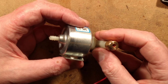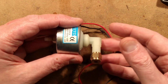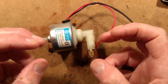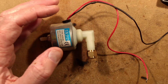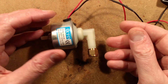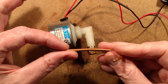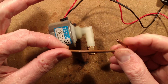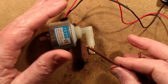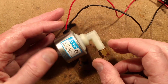Another thing that can happen with smoke machines: if you've been using cheap liquid or homemade liquid with tap water, which has hard deposits in it, the liquid gets boiled in the heater block and forms tiny droplets of glycol mixed with steam — that's the fog effect. But any mineral or salt deposits will build up inside the very thin smoke machine pipe. One option is to flush it periodically with white vinegar diluted with water — that's an acid which descales it. Do it outside though, because hot vinegar vapour in the air is just horrific. It's somewhat controversial, but smoke machine companies used to recommend it.